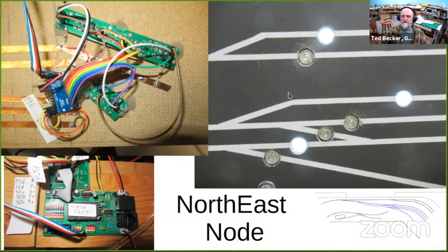The problem with them is the pins on them are very delicate, and you would break them off if you tried to hand wire, so they have to be on a circuit board. So I made up a circuit board that could cut into strips, and it's hard to see, but you see these five are in a nice straight line. Well, that's this board up here, and these other two are mounted on this board. These are wired together into one of those I/O expanders, and the connection to the Arduino is this four-wire cable, which is the I2C cable.